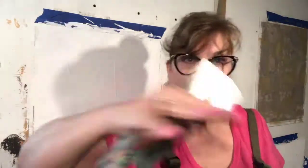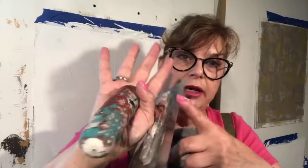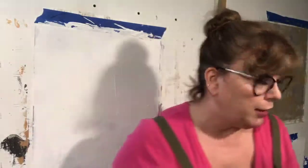Always have a wet towel to clean off your trowel when working with any product. You don't want to build up crud along the edge, because when stuff starts to dry on the trowel edge you get drag marks through your product.